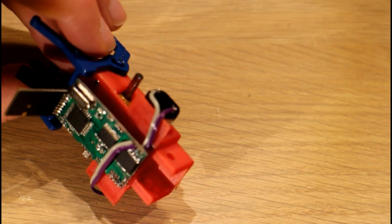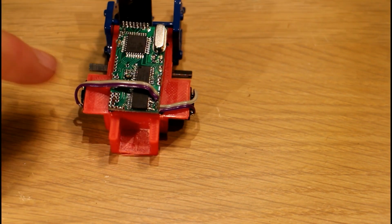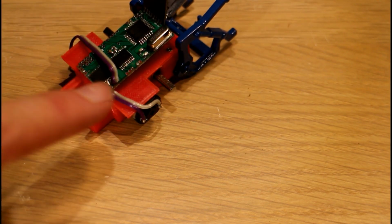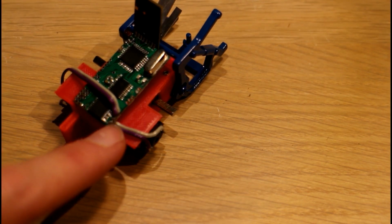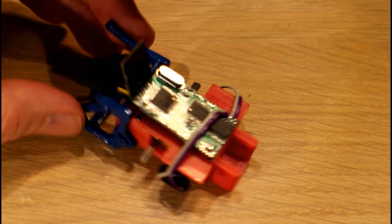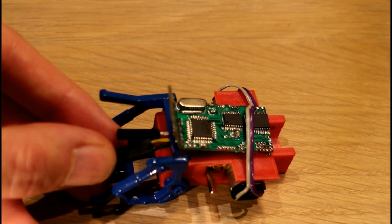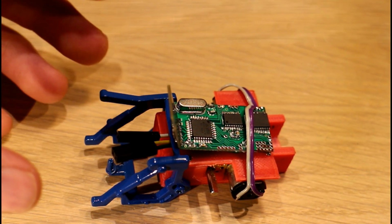Okay, well here's the 2 motors wired up. You can see we have our 2 N20 motors there, output shafts sticking out either side, and we are connected here to both motors coming back to the side of our TB6612FNG motor driver there. So everything there is pretty perfect. I added a power, a ground, a power and a signal so that I can hook up to a trailer.